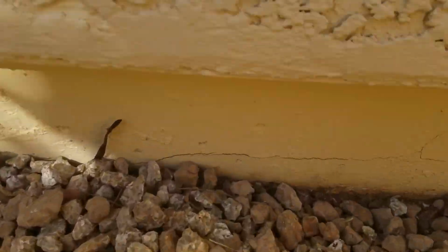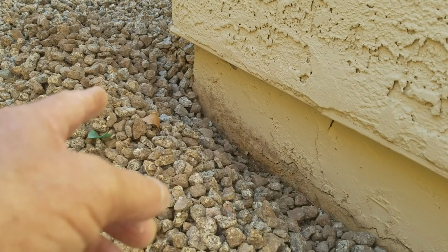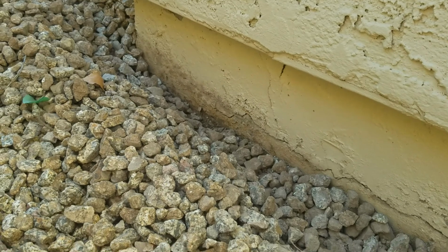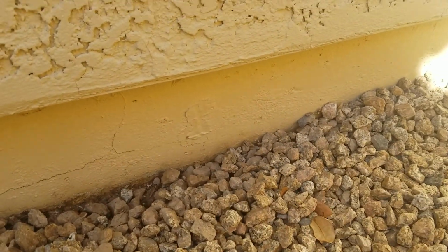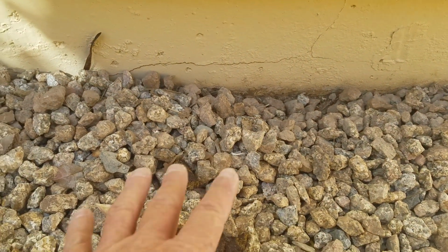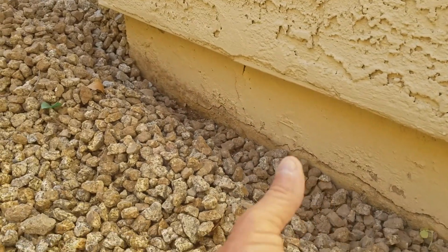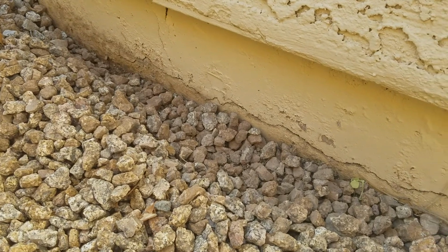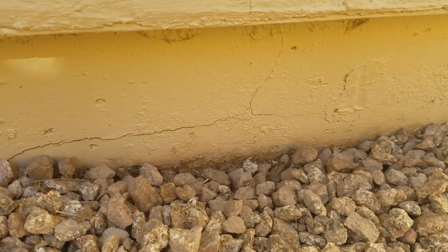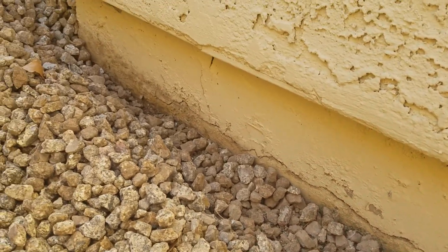Then we get here. This horizontal crack is oxidized rebar, and it goes just to that corner. It doesn't go around. I didn't see that it continued past that location right there. So we go past at least 24 inches, 2 feet to make our repair. We excavate, move the dirt back, put tarps down, excavate the dirt, chip out everything that's chipping, cracking, and flaking, and then we remove that steel. We cut it. We stop the low voltage electrical current running through it, replace it with new number 4, 5-inch rebar, epoxy coated, and then structural grouted back into place out to a smooth paintable surface.